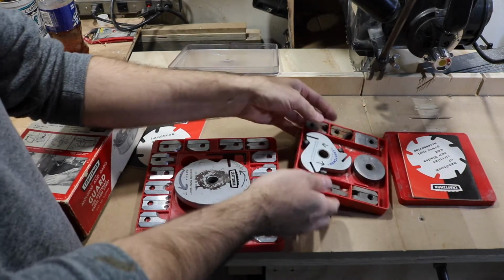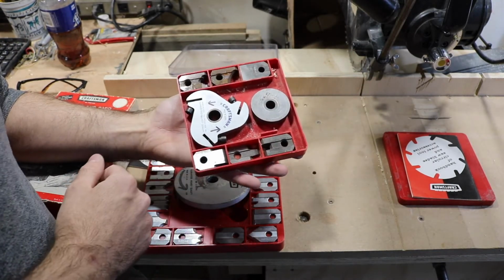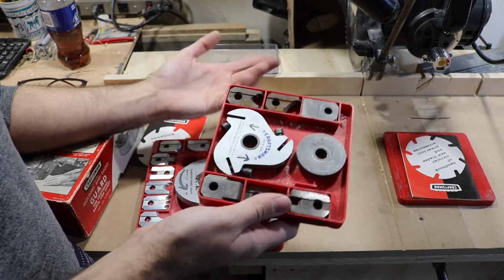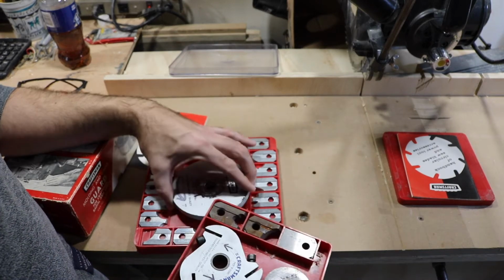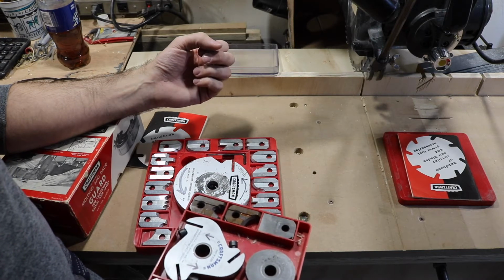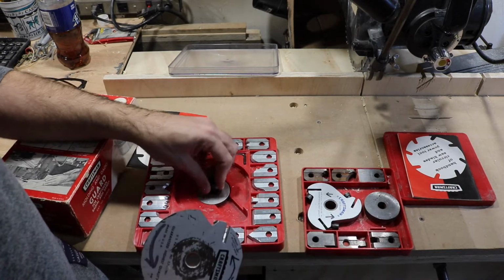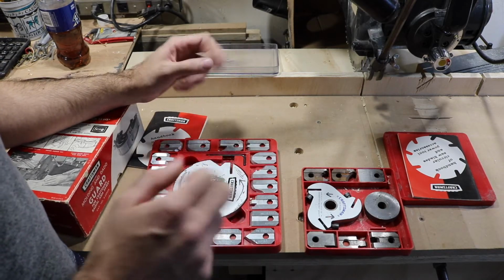Also available was the tri-cutter. It typically came with fewer cutter heads, so you had to buy more to go with it. Supposedly it creates a smoother cut. My personal experience is this one seems to do just as good as this one, I should say. I honestly can't tell the difference. Maybe if you went through some really expensive hardwoods, it might be beneficial to have the 3 cutter heads, but I would suggest trying to track down the single cutter head, since you're trying to do this on the cheap. You're going to be using softer woods anyways.